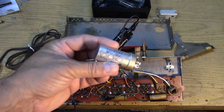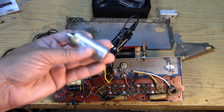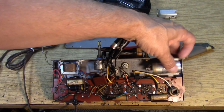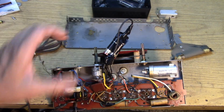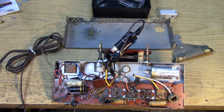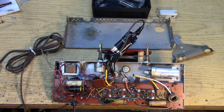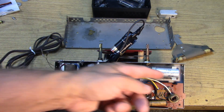Here I found a supposedly perfect capacitor. It's 215s at 300 volts. And look, it would even snap right in. So, wow, look at that, huh? Doesn't that look like it belongs in there? And it's even self-grounding. Well, the problem with that is that it is self-grounding.